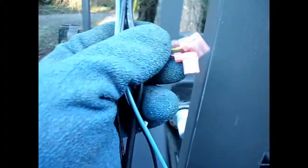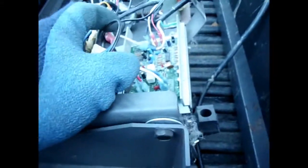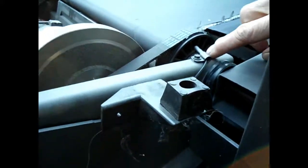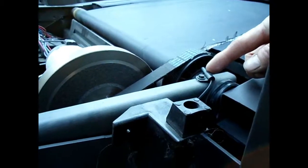Usually your electronics are always hooked up with these types of connectors, and these little connectors are kind of pricey — they've been put on at the factory with a good quality factory tool, so we want to leave all those and not clip any of this. Plus we've got this nice housing here we can reuse too. All these connectors are quick connectors. Here we've got a fuse reset. And here's another handy little component — this unit right here is a speed sensor, an optic sensor. You can see these slot bars here on this belt drive wheel, and this is going to count the revolutions, so we want to take care of that. We're going to probably reuse that for speed monitoring and other things.